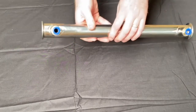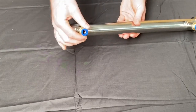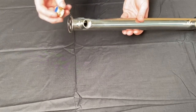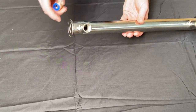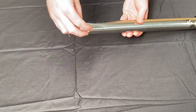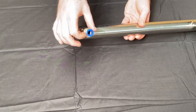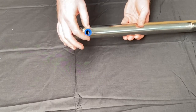The other major feature of these condensers is the flexibility. Standard they'll come with these push fittings — these half inch threaded push fittings. But they can screw straight out, so the flexibility that gives you is you can put any types of fittings in these threaded fittings. So any ball valves or stainless steel ball valves you want to put in there, you can quite easily just thread them straight in. They come standard with these push fittings but you've got the total flexibility to remove those push fittings and put in any other ball valve fittings that you like.